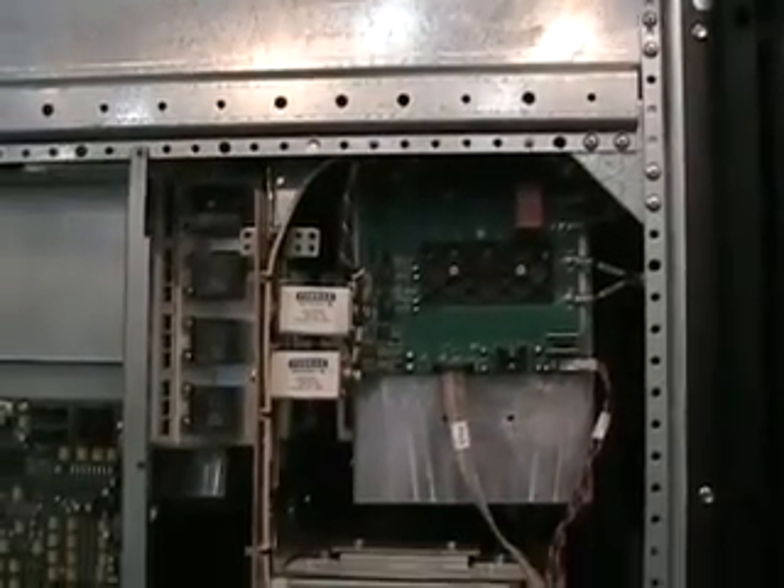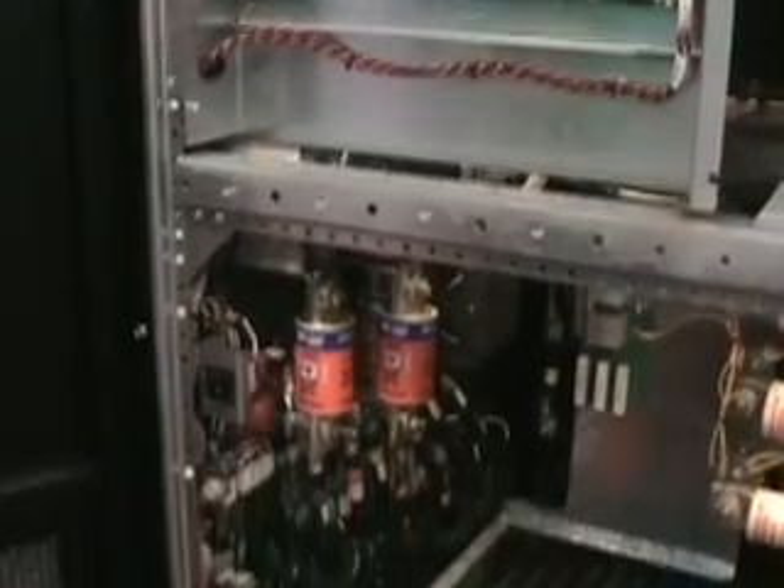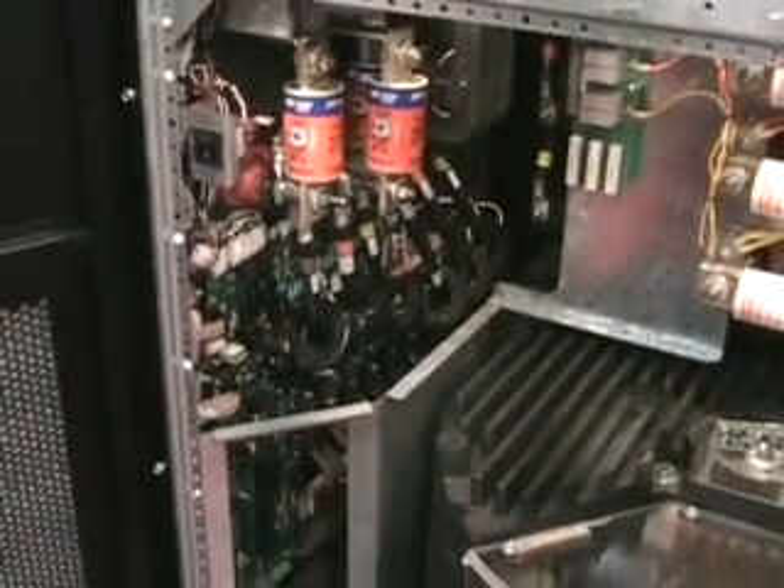And a 600-pound flywheel is not going to stop turning — that's right. This is a 300 kVA UPS flywheel system. Within this little box, you have essentially your battery and your UPS, which is a very compact footprint — almost a third of that of batteries. Yeah, because usually the big Liebert systems I see in data centers are huge. Absolutely — they're big and very heavy.